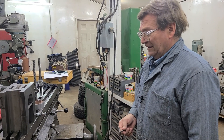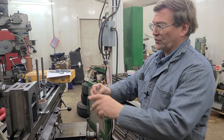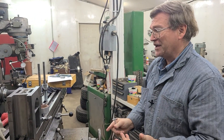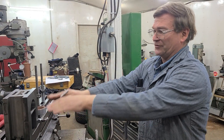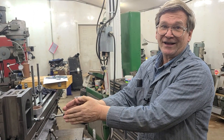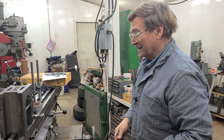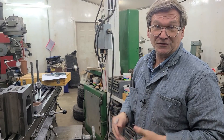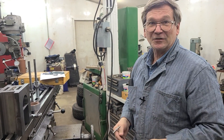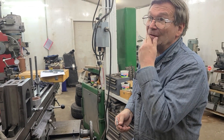It will make some difference too if when I split the bushing, if it doesn't change any and the diameter just stays there, then it's not that much of an importance whether we're pressing in or not. But if the bushing shrinks in a little bit, then I didn't want to just turn a half bushing and try to figure that out. You could turn it to size after it's already split, but measuring it again is a little bit more difficult.